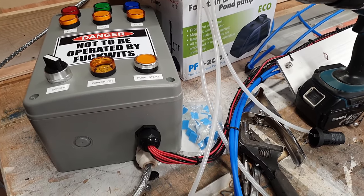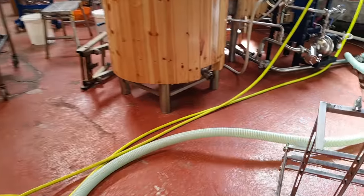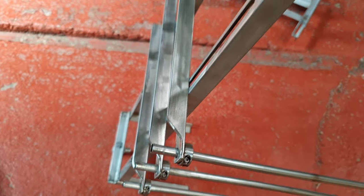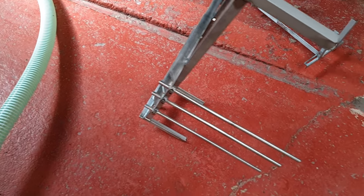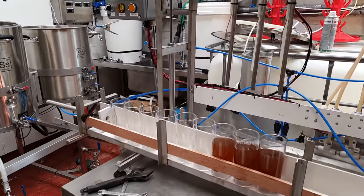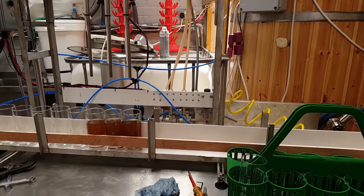We've got another three cables to bring out here which will loop round over the top and go onto the fill rail. Another point worth mentioning: we may have to electronically isolate each rail individually from the chassis — maybe just a fiber washer underneath those two sections or under the bolt. We'll see how it goes, but we may need to do that to avoid false triggering where one can sensor sets off another.